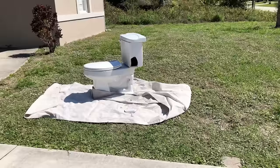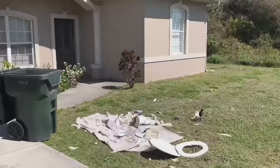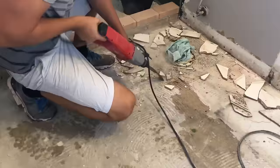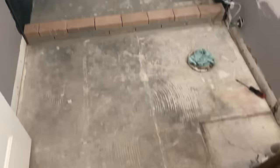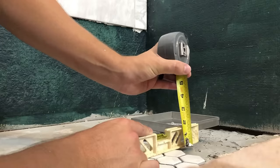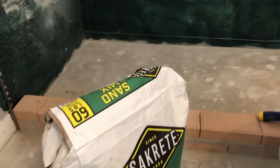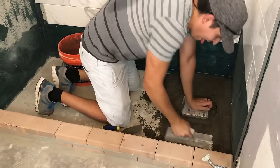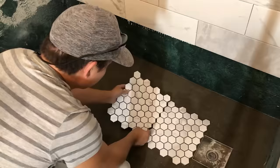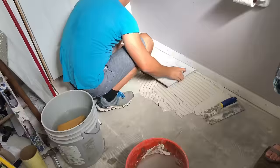I placed the toilet in my yard and had a little fun destroying it with my oldest daughter. Then I removed the rest of the tile under the toilet, cleaned the floor from all the debris, and the floor was ready for tiling. But first I filled the drain area with cement and started prepping the floor for mudset. I marked all the walls to indicate the mudset level and began to level the shower floor. Mixing the mudset is fairly easy — you want a snowball-type consistency. For detailed instructions, check out the links in the description.